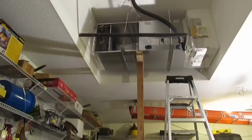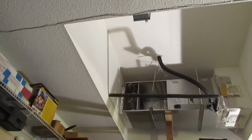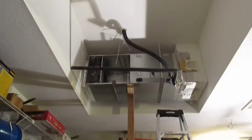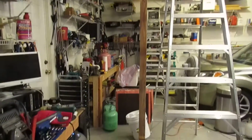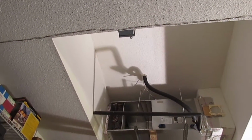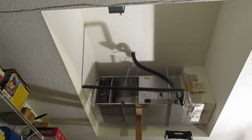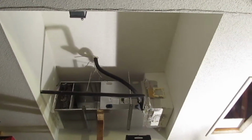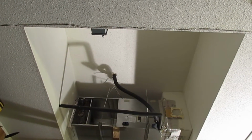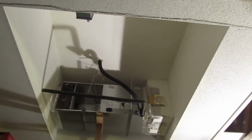So it's up there. That's a 10-foot step ladder I got there right now. But maybe you can see, maybe you can't. I already have the motor out. That's what that support is there. I had to build a support because the strap hangers and things that they have supporting this air handler block the access for the motor and the coil. So I took the motor out first. It seemed to be the easiest one to get out of there, and I'm going to get the coil out.